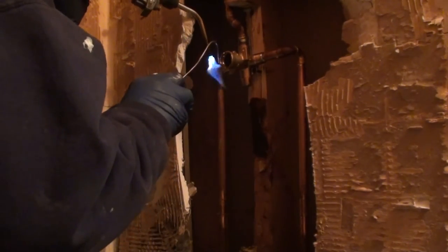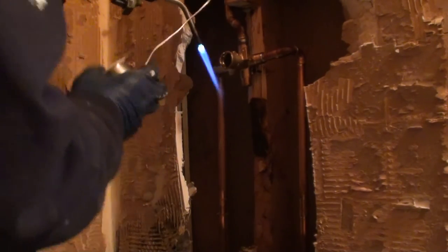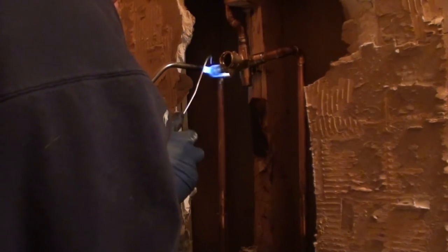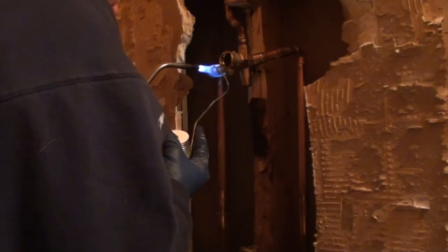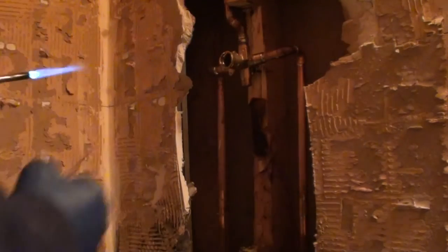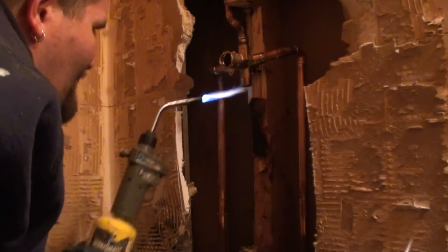Grip on the bottom, it's because that joint is full enough of solder that it's all I need anymore. It doesn't hurt to go all the way around the joint just to make sure that you got it full like you expected to. Normally once it's sitting there melting and has a near finish, you can pull your heat off of it.